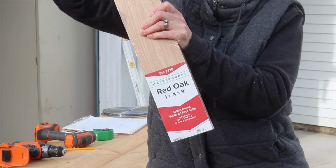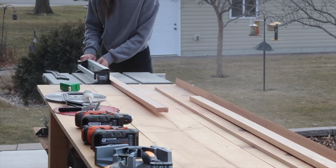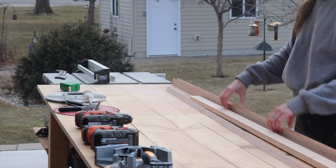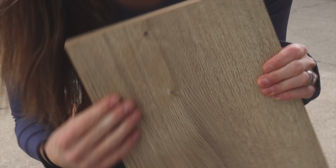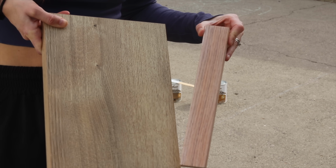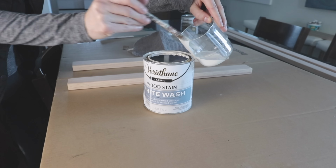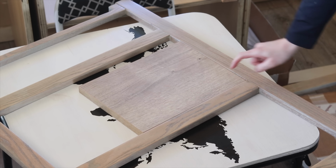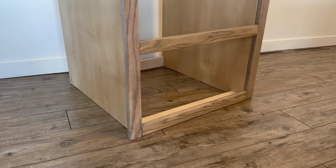The biggest learning curve came from working with oak for the first time. Cutting red oak required me to buy 2 new blades on my saws, and it was impossible to stain. I set the difficult challenge of matching the finish of my red oak trim and face frames to prefab doors and drawer fronts. In order to neutralize the red oak's pink undertones, I tried dozens of stain combinations before landing on a custom mix that the artist in me concocted with oil paints. The green neutralized the red, and I finally got the stain finish I was going for. Do you think it matches the prefab panels well enough? I've built a lot of things, but nothing tested me as much as this island, as you'll watch throughout this video.